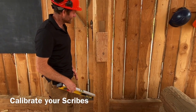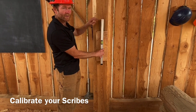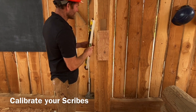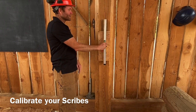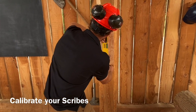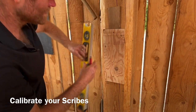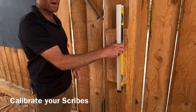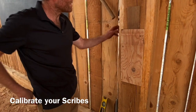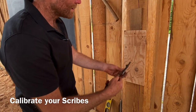Here's our leveling board, which is just a piece of 3/4 inch plywood that's been mounted in a plumb fashion in this orientation. So we put it on our post, and we have a small cedar shim here that plumbed us in perfectly in that orientation. Now we need to put a level line on our plumb board to give us the other orientation. So we'll just draw that on. So now we have a representation plumb in this orientation, level in this orientation. Now, this is what we use to register our scribes against as we set our bubbles.